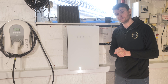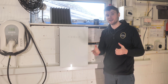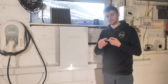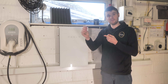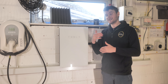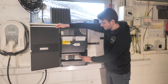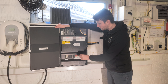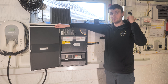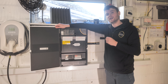Let's talk about how the Tesla monitors what's going on. It's similar to other battery systems with one difference. Most battery systems have CT clamps — a clamp around the main incoming supply to monitor import and export, and another monitoring what the solar is producing. The Tesla is very similar: inside the gateway it has the ability to monitor solar production through a CT clamp. So behind here there's a CT clamp on the supplies going out to the SolarEdge inverter and the Sunnyboy inverter, monitoring what both are generating.